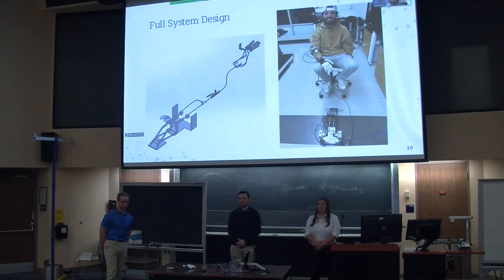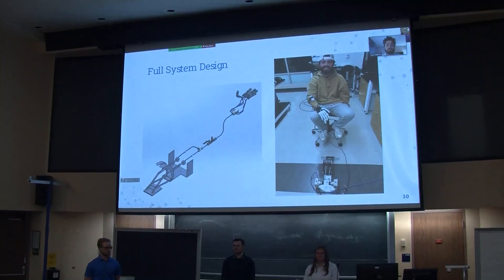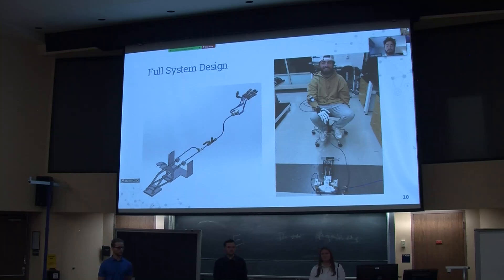This is the full system design. Starting from the top on the left-hand picture, we have the hand itself, which is made of soft actuators. Coming from that hand, tubing goes into a six-port manifold. This manifold distributes inlet air into all five of the fingers. At the bottom of the six-port manifold, you can see an inlet port. That port runs tubing into two valves — one is a relief valve set to around 100 psi, just in case the system overpressures, and it can release air through that. In series with that valve is a manual release valve for additional safety, which can be manually toggled off so the system doesn't keep pressurizing.